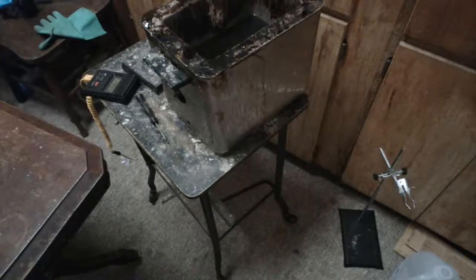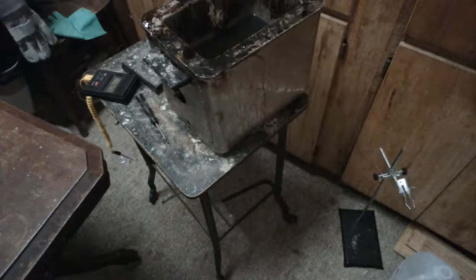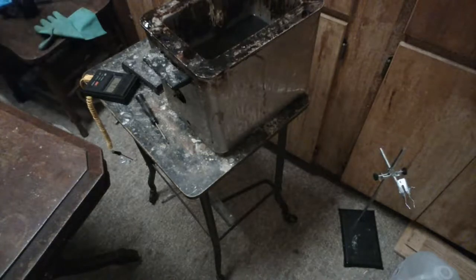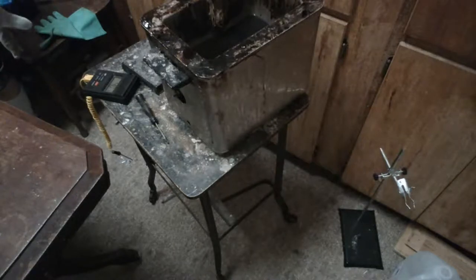So they molded the brown wax at 330 degrees on this revolving table. One guy poured the wax in the mold, and then another guy wrapped wet rags around the mold. Another guy yanked the outside of the mold off. It basically had this wooden clamp, and there was a hanger on the side of the table, and they would yank off the outer tube, and then they would unscrew the record with buckskin gloves. And that's how they made them back then.